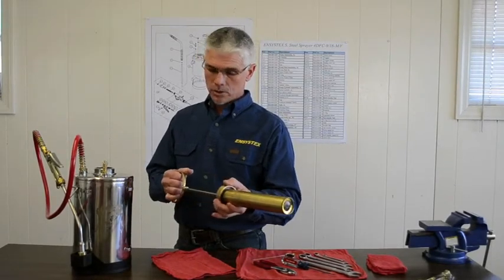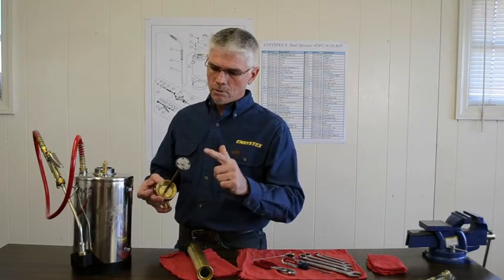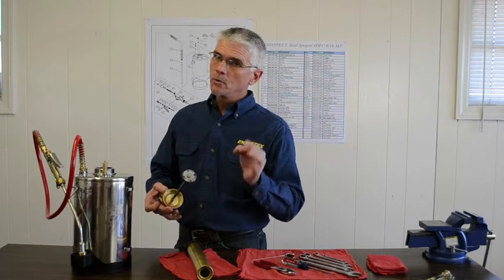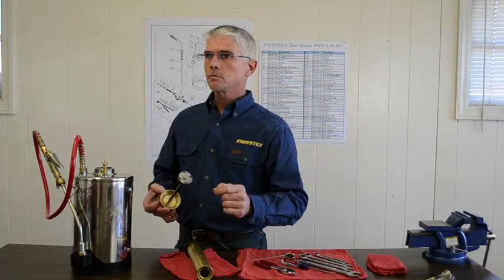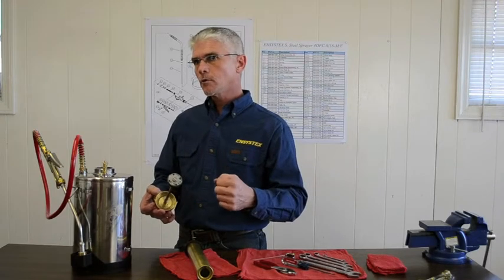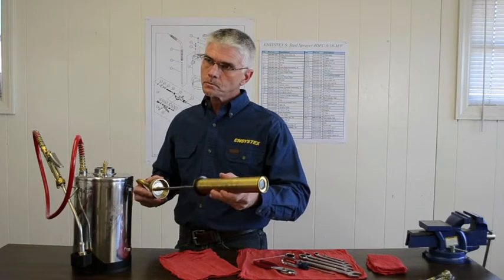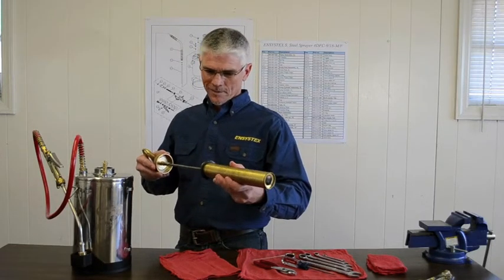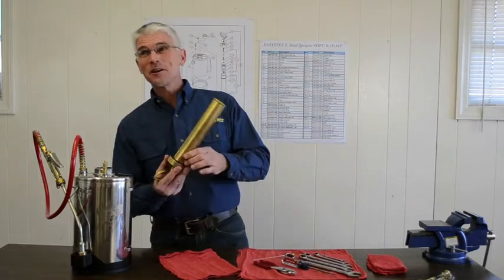So that being said, I would say the only big difference, of course, is stroke. But a neat feature at the end of the day for us with our pump assembly is that we employ a Viton O-ring, which accomplishes all of that work with the least amount of friction. So you've got a smoother operation, less pumping necessary to pressure the tank to a point where you can apply chemical. In my territory, they call that Viton. Baton Rouge, they say Viton. Or some variation of that.